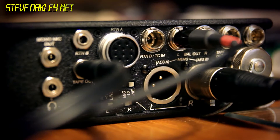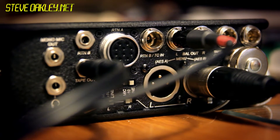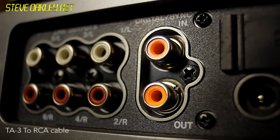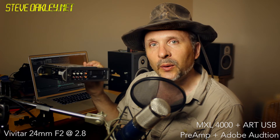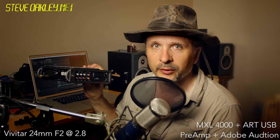The next thing I did was a little bit more interesting. I set up the Sound Devices 552 mixer to output AES on one channel of the TA3 output, then ran that TA3 output as AES into the Tascam on its AES input. And surprise — they locked up perfectly. Well, real close — within four samples of 48K.